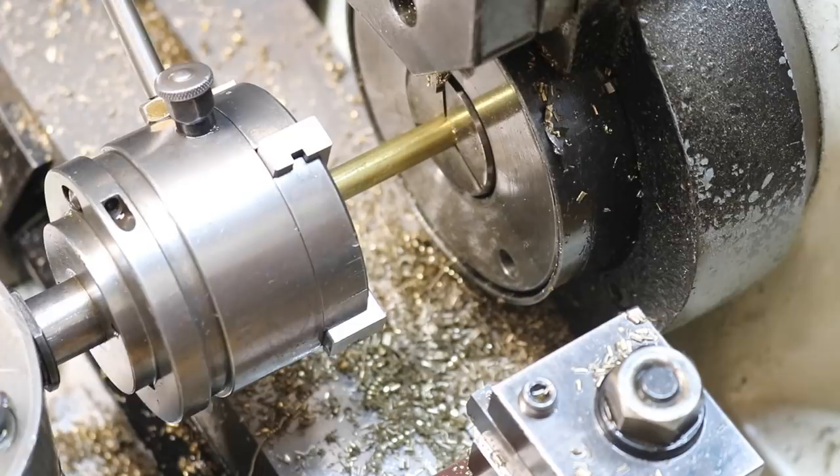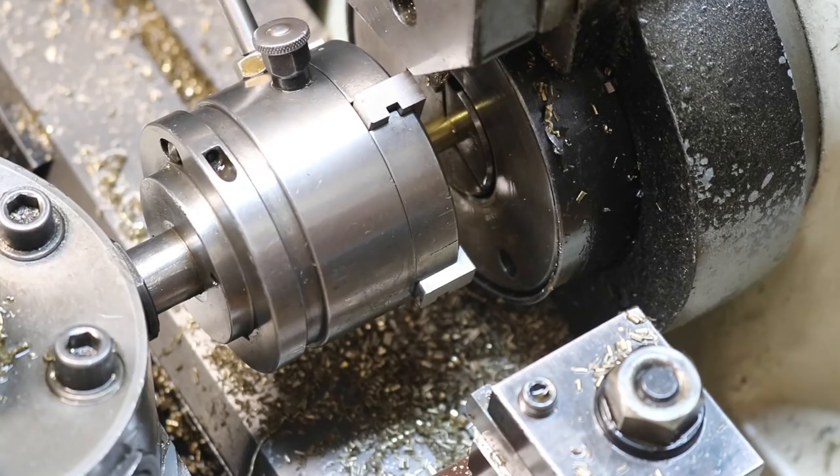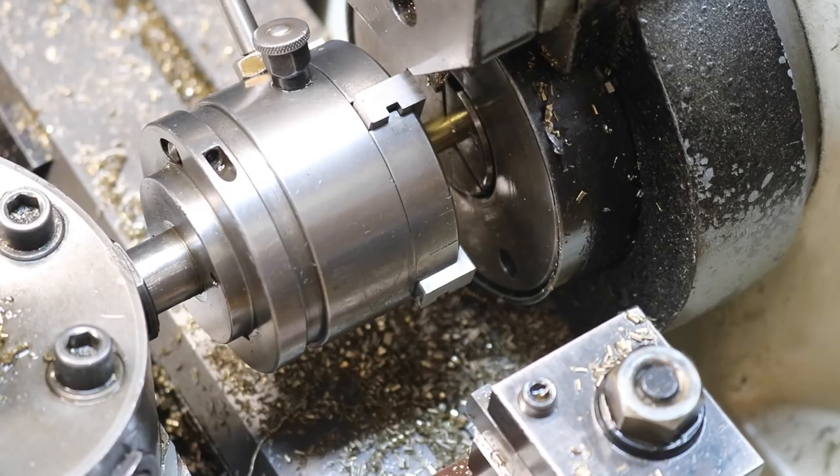And it gives you an awareness of your tooling. So you want that thing so you just barely have to help it. And if you have to start really helping it a lot and pulling it in, when it starts to open prematurely, your dies, your chasers are dull. And you want to change them out or sharpen them. Just an FYI.